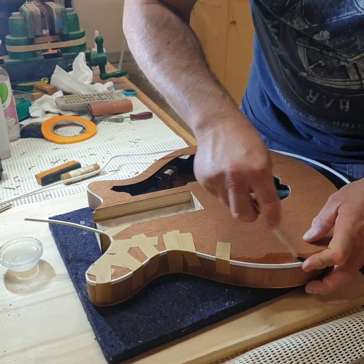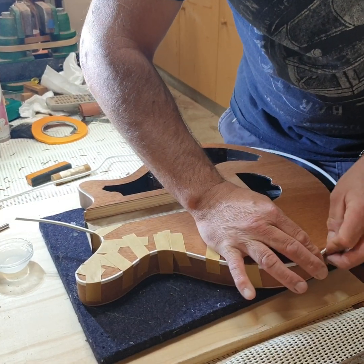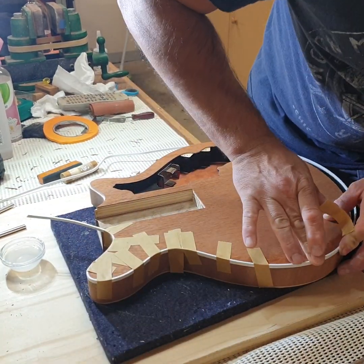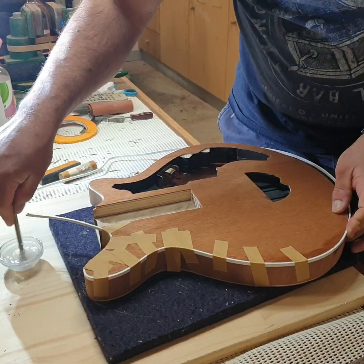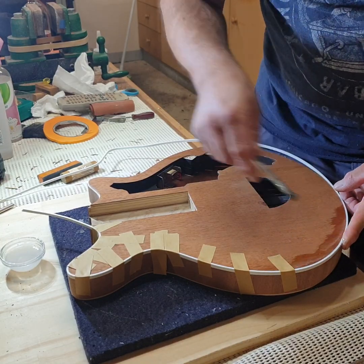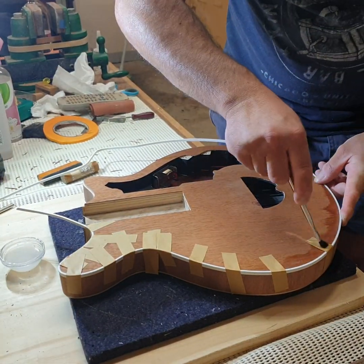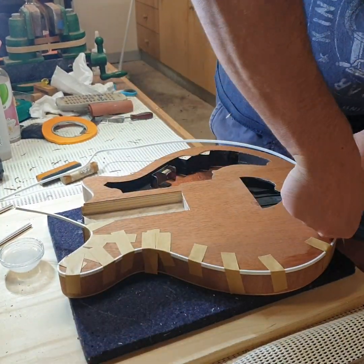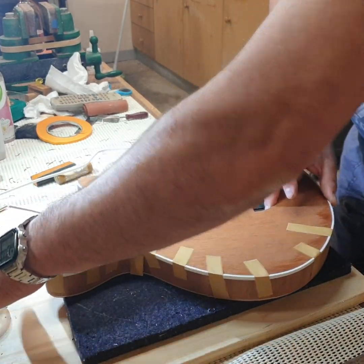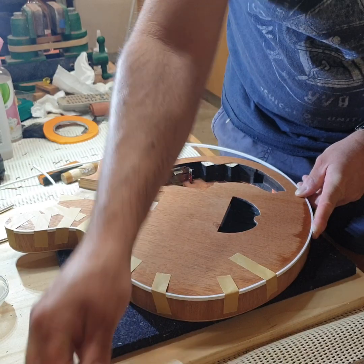It really pays to get a tape dispenser. You don't want to be tearing little pieces and sticking them onto your bench. You get a tape dispenser, because this is all about being organised and prepared. You can really saturate it if you want. Be quite liberal with your application. Because acetone's such a thin chemical, it really flows into the little nooks and crannies. You don't need much. A little bit of acetone goes a long way.